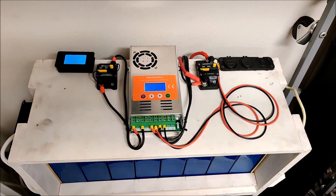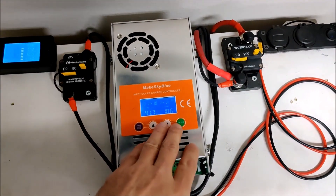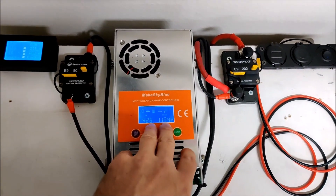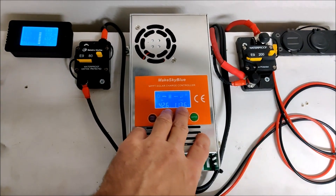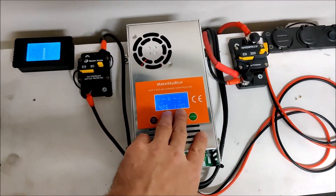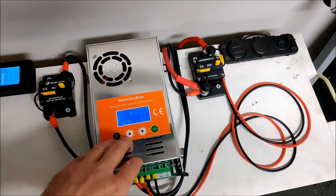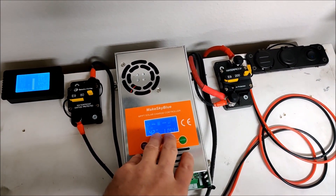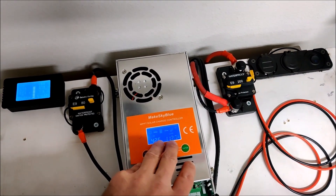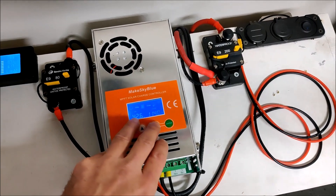Power wall is back operational. Breakers are closed, solar is coming in. Unfortunately it's a cold winter day here and so there's only 100 watts coming in, which is nothing — this isn't going to stress those bus bars yet. I'll wait until a sunny day where I get 500 or 600 watts through the bus bars and I'll keep an eye on them. I'm happy I made that change. I feel more confident with these bus bars — they're just overall beefier.